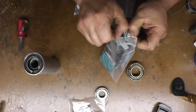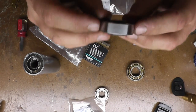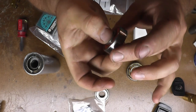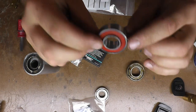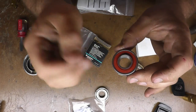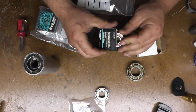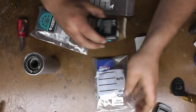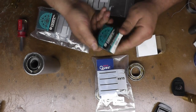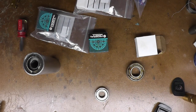The 88016 bearings were the most expensive out of the bunch, and you can see they are a little bit different than a regular bearing — you can see it has the extended inner race. So these are a little bit harder to find, and even though the part is smaller, this was pretty much twice the price of that. These are actually Japanese — there's NTN on it even though it's a Federal Mogul, which is probably just a distributor.